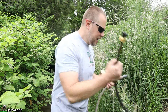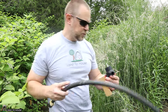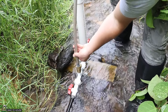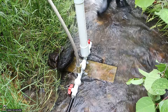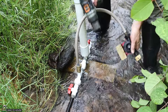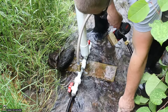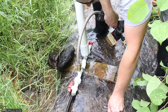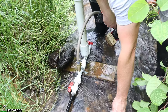Let me show you how the drill pump is done. I've got one end going into the waste valve of the ram pump and another end bringing water in from the creek. I'm attaching the garden hose end to the waste valve, and the other end of the hose goes onto the drill pump. I hook up the drill to the drill pump, get some water primed in here, close the delivery pipe on the far end, and this begins filling water up the drive pipe. I'm going to run this long enough to take all the air out the back end up at the source.